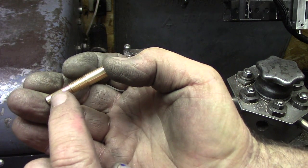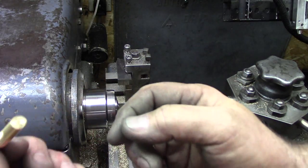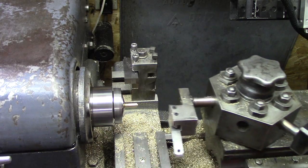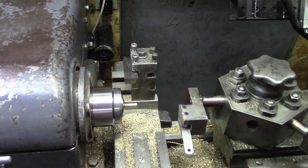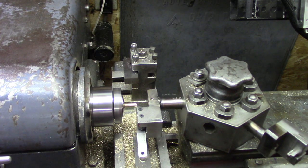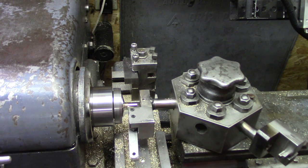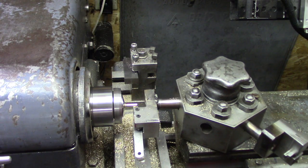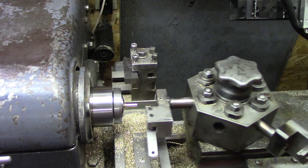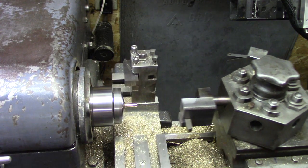Here's our blank. This end has been turned, threaded, and the hole in the end done. Now we're going to be turning this end — the grooves and the radius. Piece goes in the collet. First, I've got to get rid of that nub on the end — that kind of screws up my length if I don't. So I'll just file that off real quick. Turn it down. It's taken off a thousandths even on that spring cut there — there's no support on it. We'll come over here, put our four grooves in, then come in and radius this.